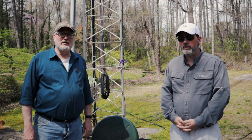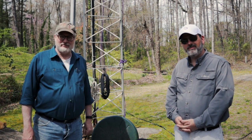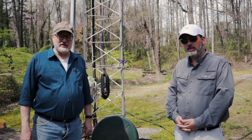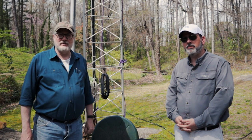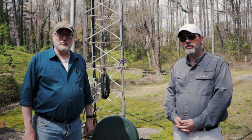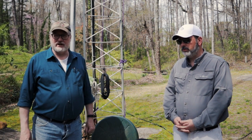Take a look. Hi, I'm Marc, N4UFP, and I'm here today to talk to you about the construction and installation of the ZS6BKW multi-band doublet antenna. I'm sure somebody is going to ask right now, what the heck is a ZS6BKW antenna? You're in luck, I know the answer. It's a very simple wire antenna, approximately 93 to 94 feet in length, fed in the center through a piece of 450 ohm ladder line about 39 feet 3 inches long. From that point to the transceiver, it's 50 ohm coax the rest of the way.